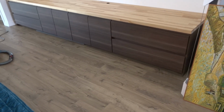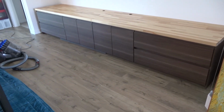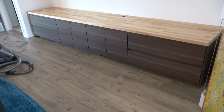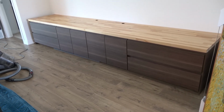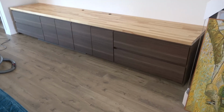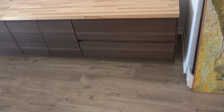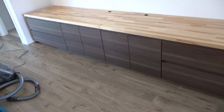All right guys, there it is, almost finished. We just have to put the little trim piece on the bottom where it sort of insets and is raised up right there. So right now you can see the little 2x4s in there, but that will just tack on there. So I'll just use a very small brad nail and a nail gun, just like 4 nails, and that's all it requires to hold it on, and it'll look fantastic. If you look at it, it looks like a custom piece of furniture. It looks really, really good, as if I had it custom made.